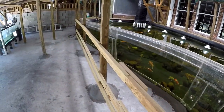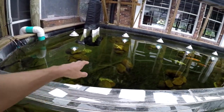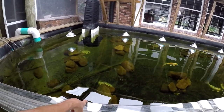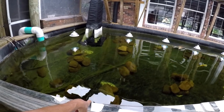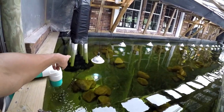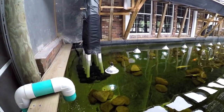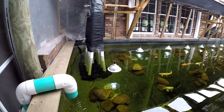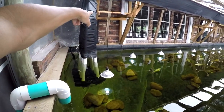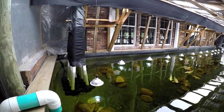The filtration and everything else is a separate, additional expense. We have 10 pumps in that corner — they're 6,600-gallon-per-hour SP Pro Echo pumps. Each has a three-inch pipe; with the head involved, flow diminishes to about 6,000 gallons per hour at roughly seven to eight feet of head. All those pipes carry water to an aqueduct behind this curtain — a wooden aqueduct with a rubber liner.